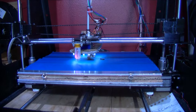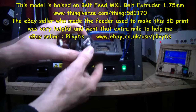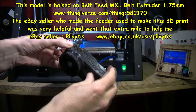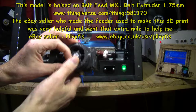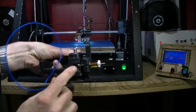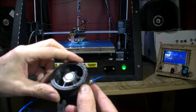Moving the camera back to show what's being put together. This is a feeding belt drive — the stepper goes through here, belt up around here — and the idea is it's going to be a quicker release. Just hook this bolt head into this sort of notch thing here. And it does work.